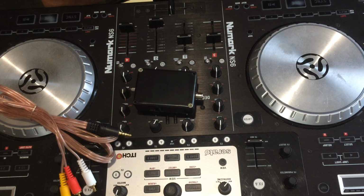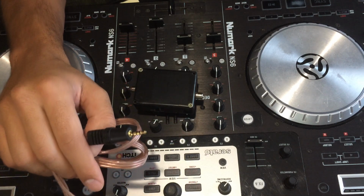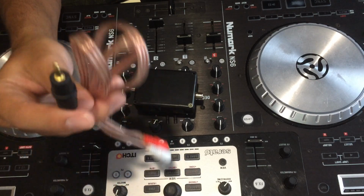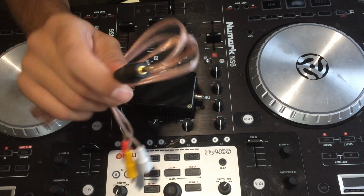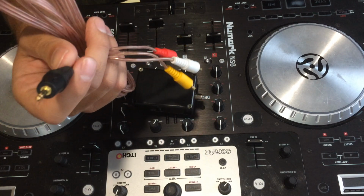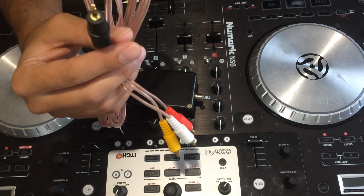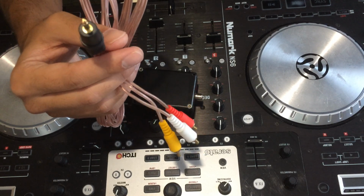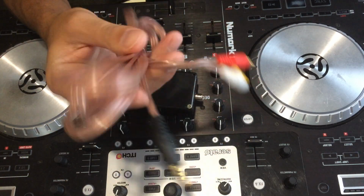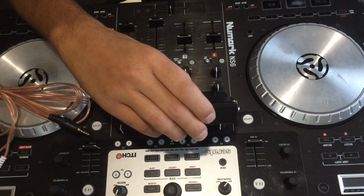Correct. So this device you can actually use on an iPhone, an iPad, your tablet, anything basically. When you plug this cable into your phone, your phone recognizes this cable as its headset being plugged in. Some phones pick it up like that, some don't. Some is looking for the actual mic's impedance, the mic's load, to tell the phone to switch off the internal mic and use the external mic, which this cable gets away with now and again, depending on how old the phone is. So this box, what makes the box different to the cable then?